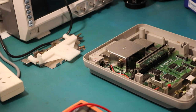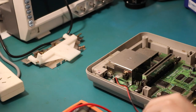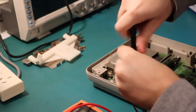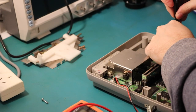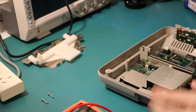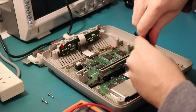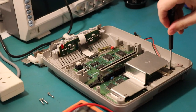As far as I can tell, the layout's quite similar to the other one I had relatively recently. Just look for screws that are screwed in. So unscrew your switch. Nothing under there. The cartridge slot has two screws, and I probably need a better screwdriver. It looks like the cartridge slot screws are slightly longer, so bear that in mind. There's three at the back. Start with the middle, and that is the same length, so that's good.